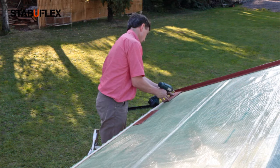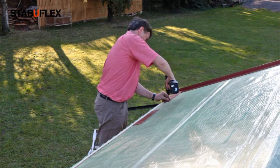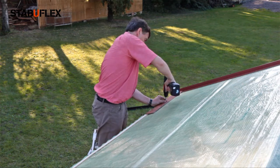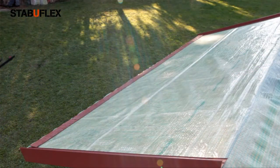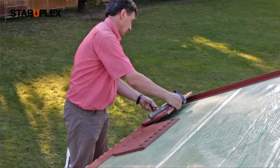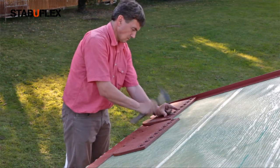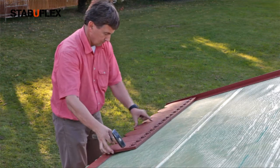First, install a row of half rectangle tiles on the camber to compensate for the curve of the first few plates. The composite plates are to be half covered by the tiles you install after. It is recommended to put nails in the second and in the fourth hole.